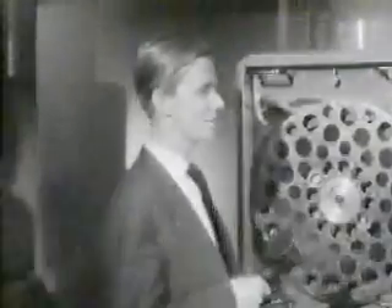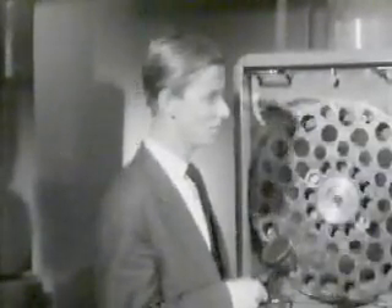I wonder if you could explain this on the machine itself? Yes, of course. There is the spool which is supplying tape, which passes over these reels, down past the recording head there, past the reproducing head here, and it is then wound up again on this reel. The electronic impulses are recorded by that head, and they are immediately available to be looked at by this head just a fraction of a second later. There is the erasing head which enables us to erase the program we have put on the tape before and record again using this recording head.